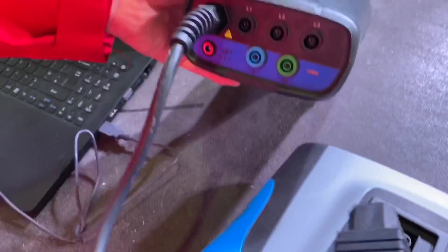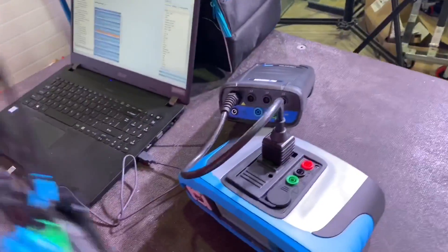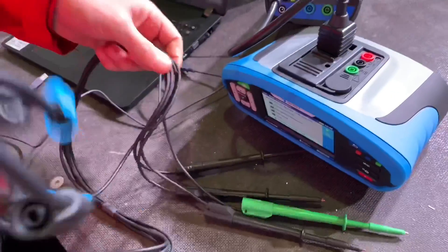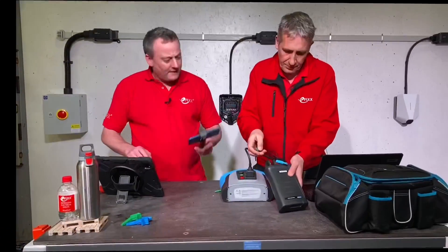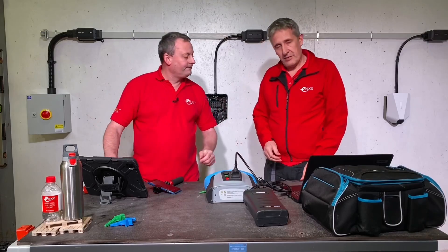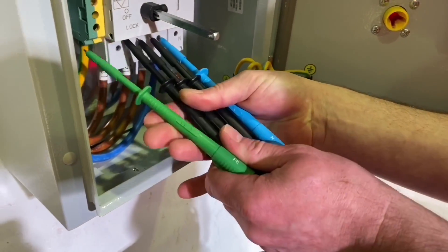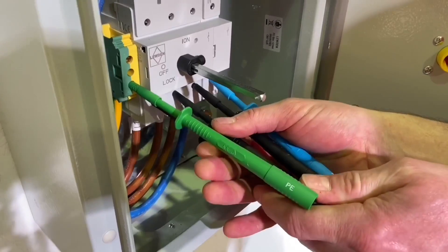Here's the port at the top - just push it in as we would any other lead. Then we're going to put our probe leads into there. It comes with a five-lead set and they're all identified, so we've got them identified correctly: L1 and so on. The beauty of this is we're going to probe onto our five connections in our DB - or in our case our isolating switch - and hold those five probes into position. You might crocodile clip some on, but you hold them in position and it's just going to flick itself through all 10 insulation resistance tests without moving. Our three-phase active switch will power up, detect a Bluetooth connection - green LED is on, we're ready to go.